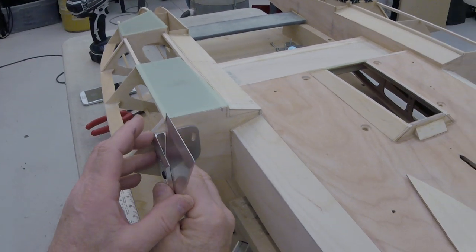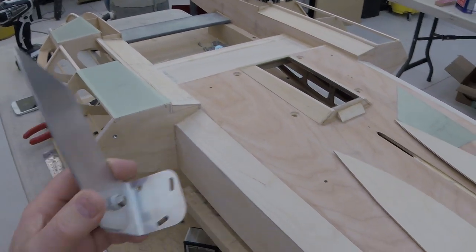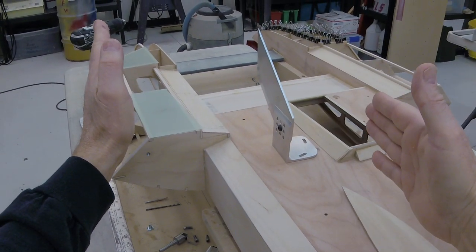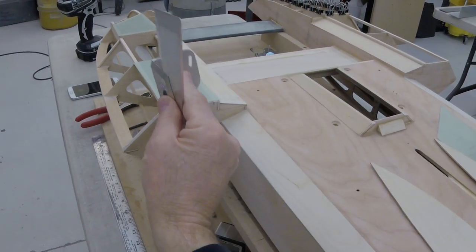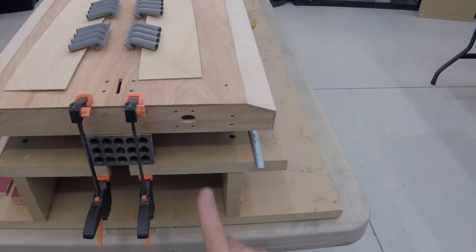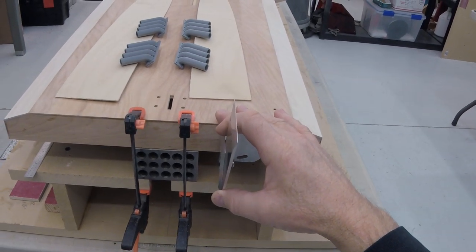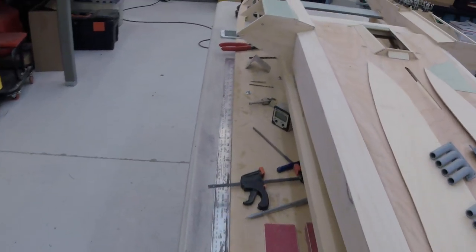Okay, I have this belief. I know some disagree. I think the East Coast way when it comes to rudders is to mount the rudder on the same side as the turn fin of the transom. I go the other way around because I want as much leverage, it's the way I think of it, on this fin as I can get. So that is why on our boat, if you're working with me, you've got your rudder mounted way over here. I don't like to do this thing. I think that's a little bit too crazy, but I definitely mount it to the opposite side of the transom as my turn fin, okay?